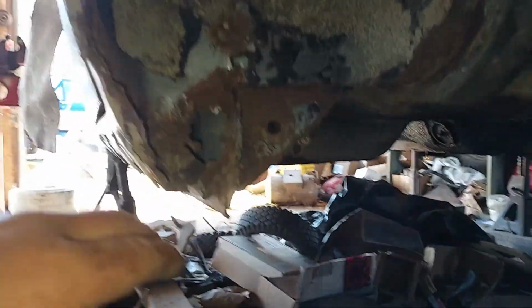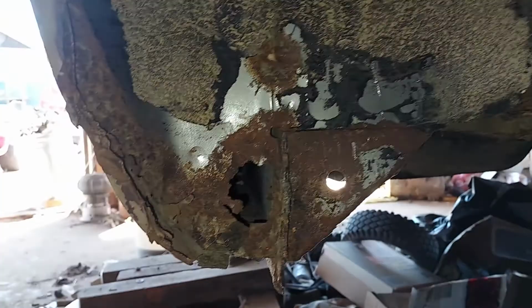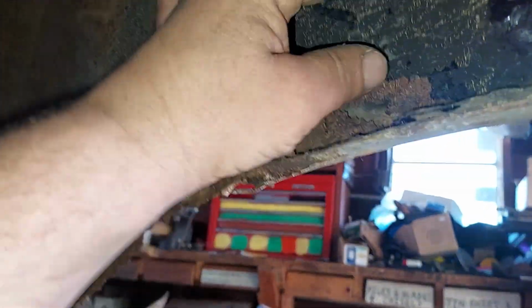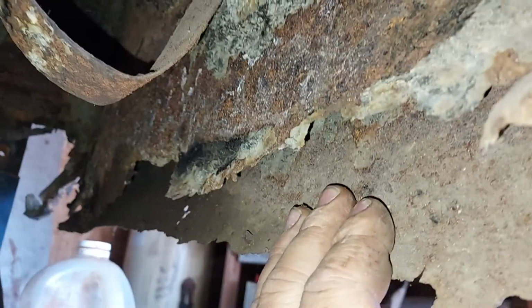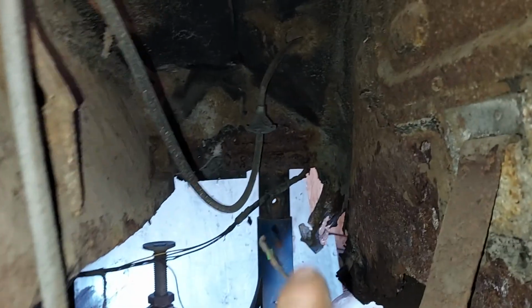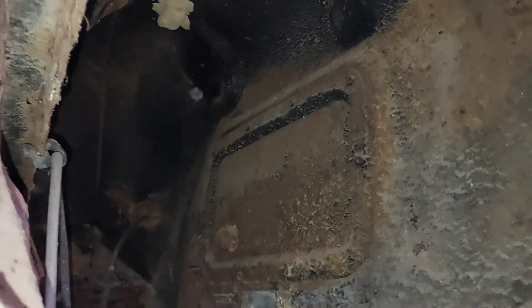Can I do the light? Oh yeah, I can. These will get pieces welded over them. Reseal those. Keep the muck out. Ouch! Ow, that hurt. This opening here will get recovered, so cut this out, weld in the new wheel arch for the inside, because this will get cut out and welded in. And like I said, the quarters, the outer isn't as bad as the inside, but you gotta go past your rust. And then of course there's a spot across there. And I still have no idea what the point of that access panel is. It goes to nothing. The panel makes no sense.